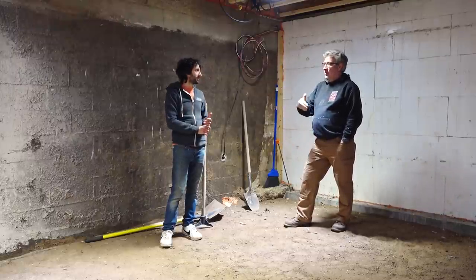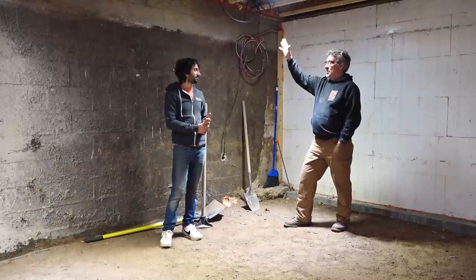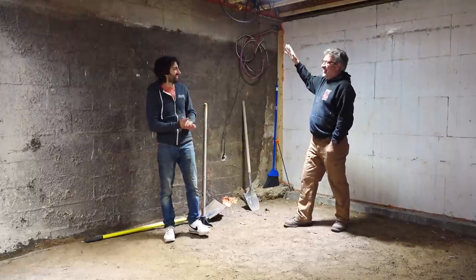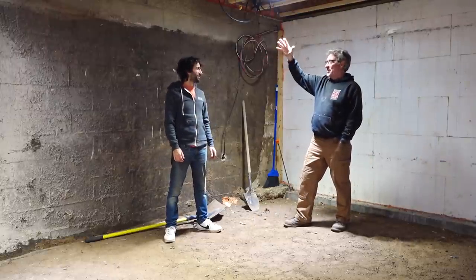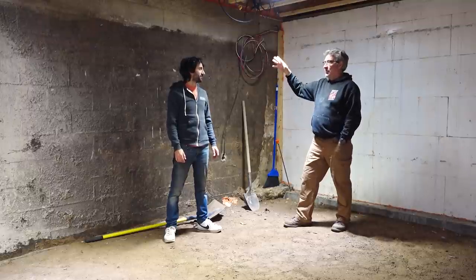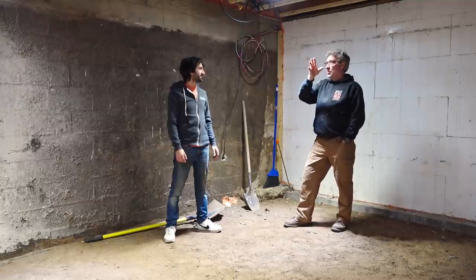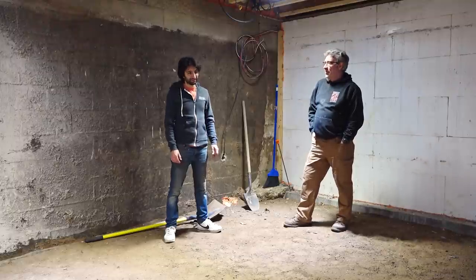And then in the middle of January, we'll completely seal this section of the house, the mid addition. You've got the original house, the addition from 15 years ago, and the one we're doing now, which we'll completely seal off so it's segregated from the house. Then we'll deck through that, get all the gutting done, and then do all of our big framing to tear out all the load bearing walls.